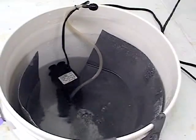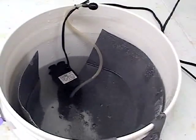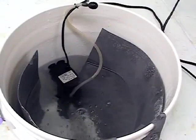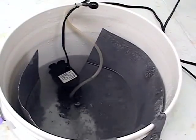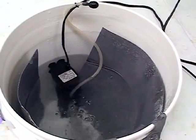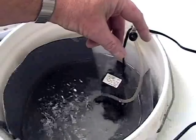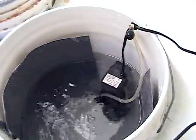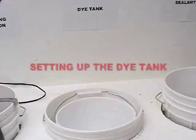The small black bulb and air tube should be fixed so the bulb is out of the solution. This allows air to be sucked into the flow, causing more agitation. It also keeps the liquid cooler. The dramatic difference between just liquid flow and air and liquid is easily seen by blocking off the air intake.